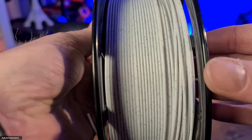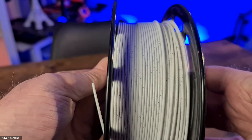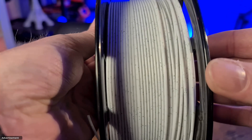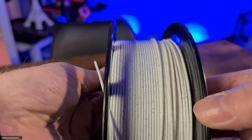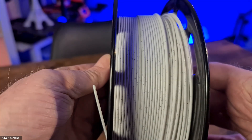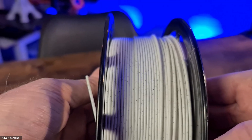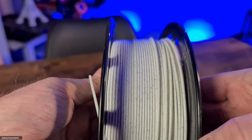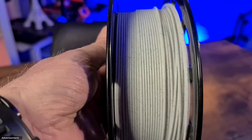As you can see, this white marble PLA has black pigments to give it a marble look. There are different marble PLAs available — some with only plastic elements inside, which I think is exactly the one I have, and there are marble PLAs with real marble content inside. Especially for those, you really need to use a hardened nozzle, because a standard brass nozzle will wear out after maybe half a roll of this filament.